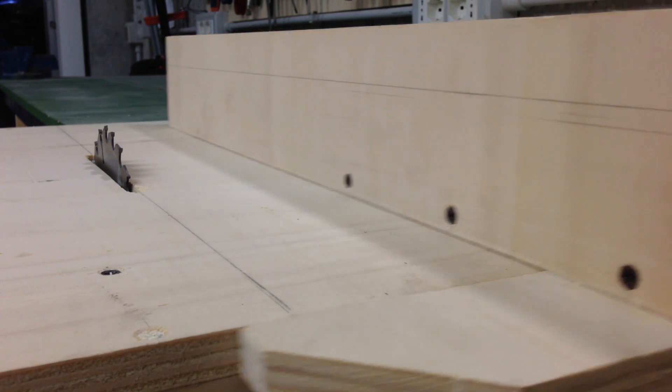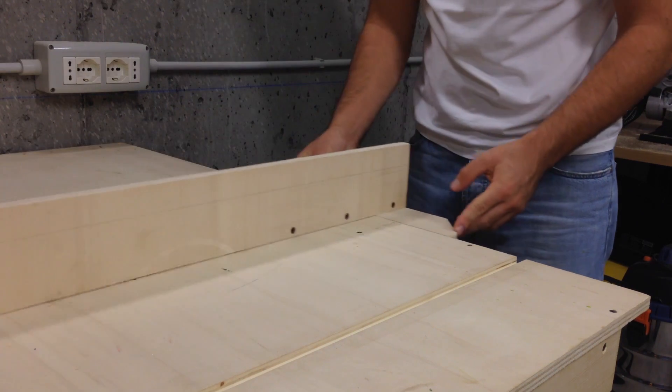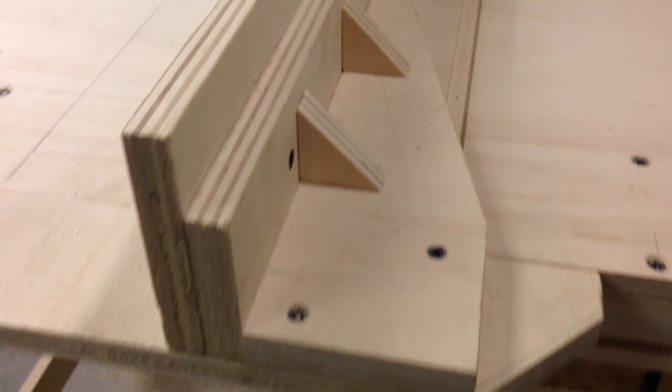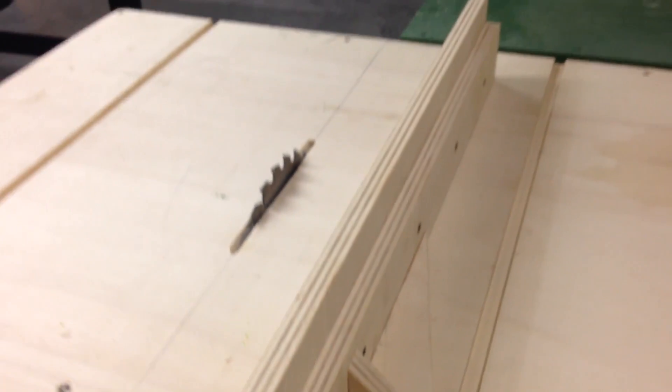And now the downside. When cutting big and large pieces, the fence bends slightly under the pressure, as you might have noticed from other videos. The reason why is that the back support piece is too small and the plywood we use for the actual fence is too thin.